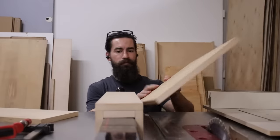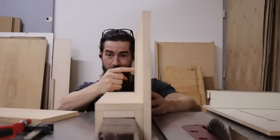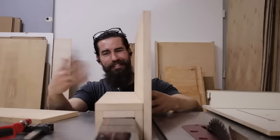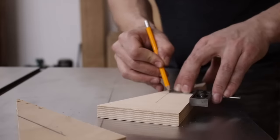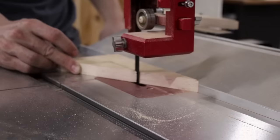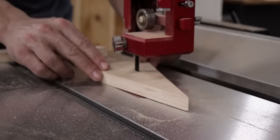Now it's time to attach the actual fence portion of the jig. However, it is absolutely critical that this stays flat and perpendicular to the table. So instead of just gluing it on like I did the last one, I'm going to add a couple of corner blocks right here as an added benefit. I'm relieving this so that I have a parallel face to clamp to if and when I need to clamp pieces to my jig — it'll just make life a little bit easier.